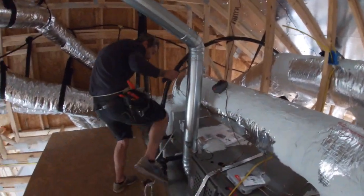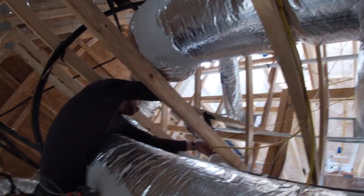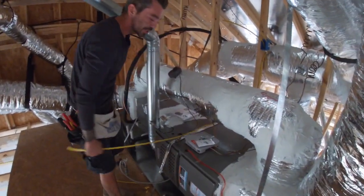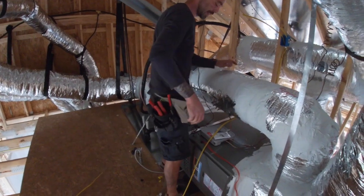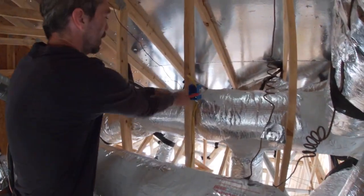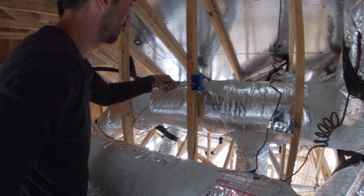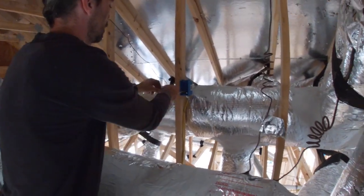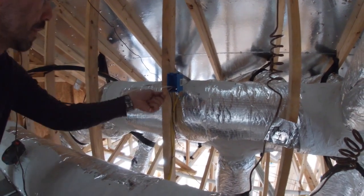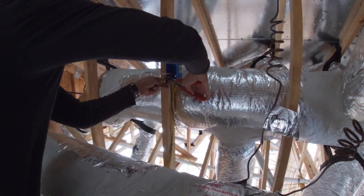I got to add another staple over here. Now that we've got our switch leg hanging over here, we'll just leave that alone for a minute. I'm going to go ahead and cut in the switch — this is just a regular single-pole switch. I'll crimp my ground.